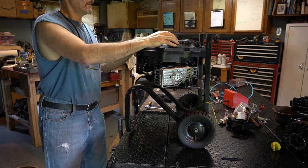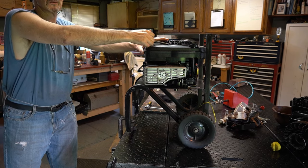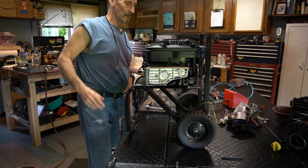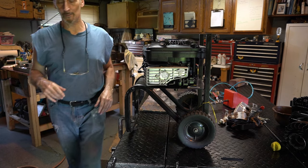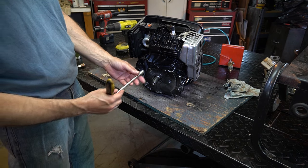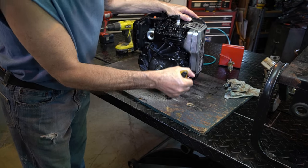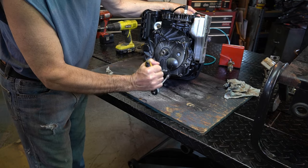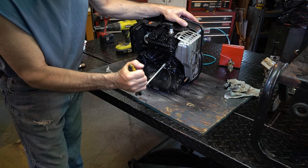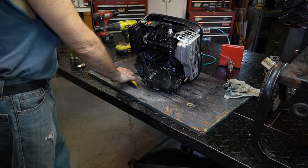The power pack's almost ready - I got the plug in, everything is on except for the Lovejoy connector. It's nice and smooth - listen to that. Before we put the Lovejoy on - these things can leak, right? This bottom plate, which is really partly your sump and the bearing, they can leak. I just want to check it. Oh, that one was a little bit loose - they do loosen up. Those all seem to be pretty good. Everything seems fine.